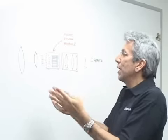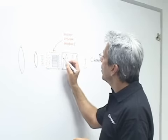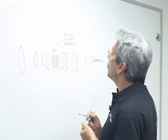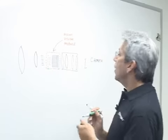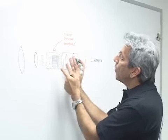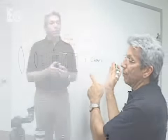The growing electron flux hits a device called a phosphor screen. Phosphor screens, when hit with electrons, fluoresce — this one fluoresces green. So the output of the night vision module will be all green. A relay lens then takes that output and focuses it onto the camera's detector. There are some interesting things that happen because of that.